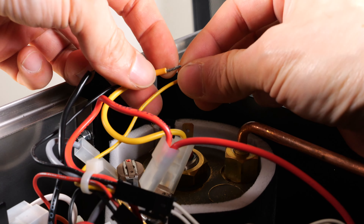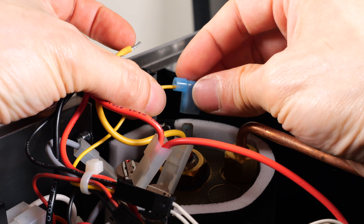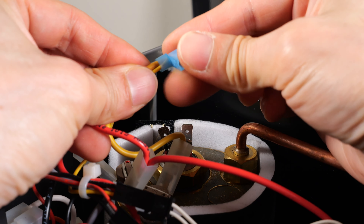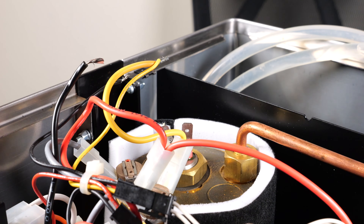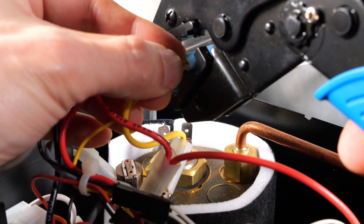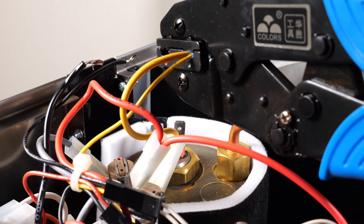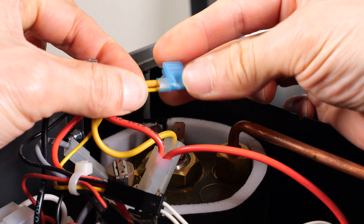I stripped the wire back a little bit and the blue terminal looks like the one that'll fit. We test it out first — it fits. It might fit the smaller red one, but it's probably better to use the bigger blue one because it has better current-carrying capabilities. Then we put it in the little slot, push it in all the way, and squeeze until it clicks. And voilà — nice and tight.